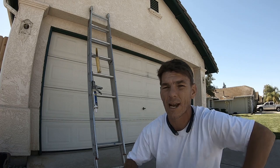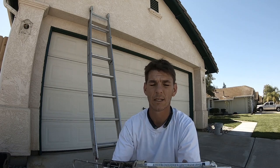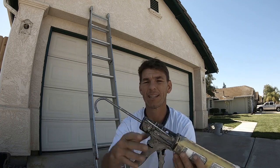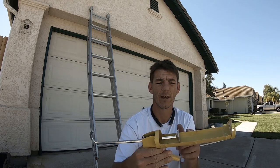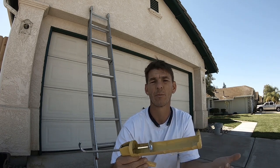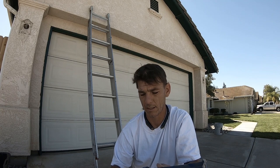Two different types of caulking guns that I really like to use. This one's a little more pricey but it's a lot easier to pull on - it's more ergonomic. However it's hard to get in tight spots because this rod sticks out way far. If you guys are interested in any of these tools I'll leave links down in the description. This one here is a dripless - when you go it kind of lets off and it doesn't drip. Because with the cheaper ones that have a trigger on the back, every time you're done caulking you have to hit that trigger, and that really takes up a lot of extra time. Painting is all about saving time and getting it done right.